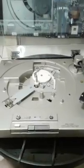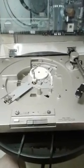I didn't like the soldering here, so I reflowed the solder and got a really good gob of solder on that wire again. I also sprayed a little WD-40 into the potentiometer itself for the pitch control and onto the 33/45 speed switch.